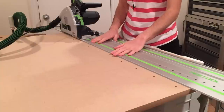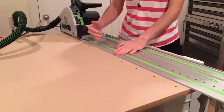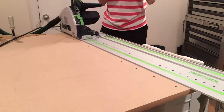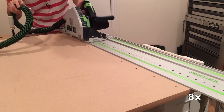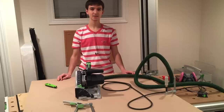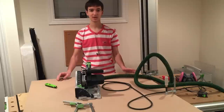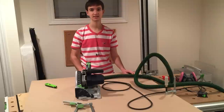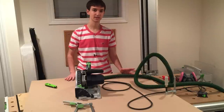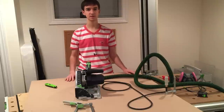Do not touch the track after drilling the holes. It's critical that this line of holes is perfectly parallel to the edge of the wood. Take your track saw and make a cut. That's all there was to the jig — you'll soon see how it helps to align the dog holes. But first, we have to cut this top down to size so it fits inside the MFT. Accuracy here isn't critical and won't affect the alignment of your dog holes, but it's still nice to get a good fit, so try your best.